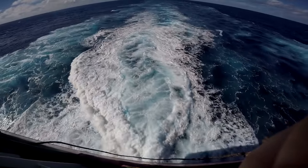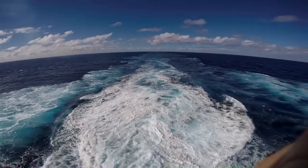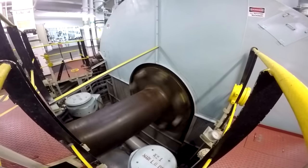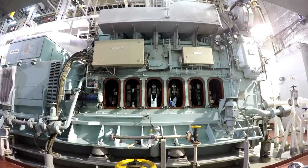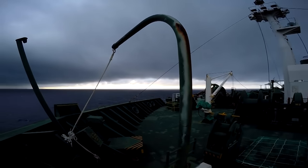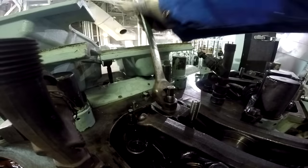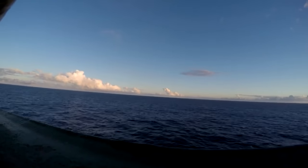We have a lot of things to tell about air compressors, a lot of things to be careful about, and the most important, always remember in all machineries, is to check the bolts of the base that the machinery stands on. Some of the problems can also start from there, as your equipment will not be aligned. So this will also lead to unbalanced working of the equipment. And sometimes the problem starts from there, which we also need to check.